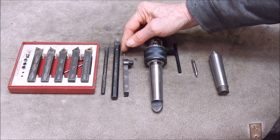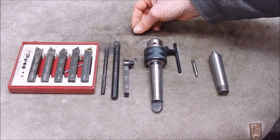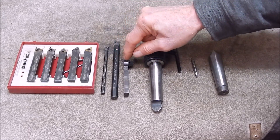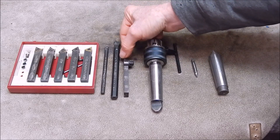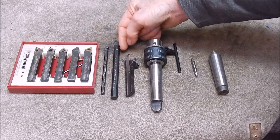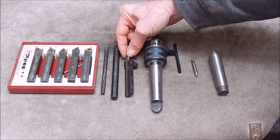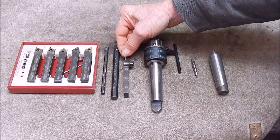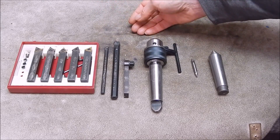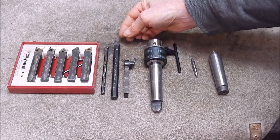Parting off blades — they're handy, not absolutely essential, but you can do grooving with them and they're very useful. The critical factor when buying one is to get one that doesn't have a lot of overhang. This one is a poor design because you've got all this mount hanging over your tool post and then the blade. You want one where just the blade hangs over — less chance of it catching, which tends to happen with small lathes. They'll catch and block up, possibly break the blade or move the job. I don't use this one anymore.